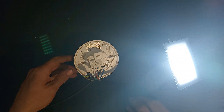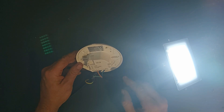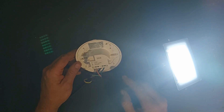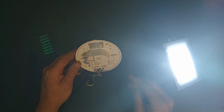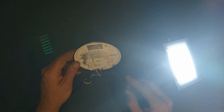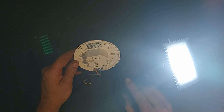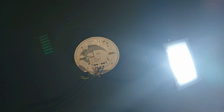I've used these in bathrooms before, or storage rooms. Sometimes when people put up drywalls they don't want to put in a new switch, or you can use it almost like a two-way switch — you don't have to put two switches, just put one of these sensors and when someone walks under it or close to it, it switches on. It's really convenient. I hope you enjoyed the video — please give it a thumbs up if it helped you.